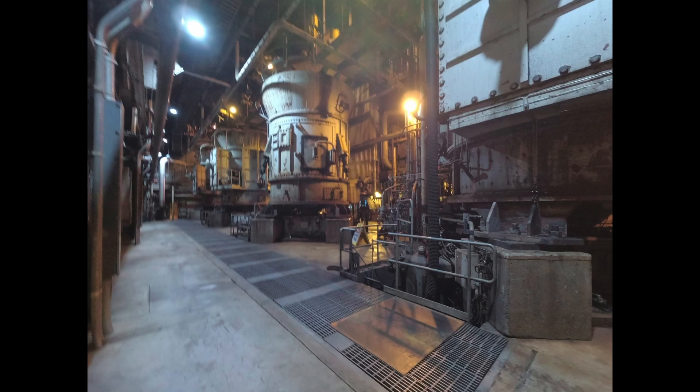Here's a view of the four pulverizers. These would feed the four decks of burners. There are eight pulverizers total — this is one side of the unit. You can see the pyrite hopper down here. Any debris accumulates in the air boxes; scraper bars carry it and drop it down the pyrite hopper a couple times a shift. A water eductor pump pulls out the gravel and coal, which is sent to a holding tank and then out with the bottom ash.